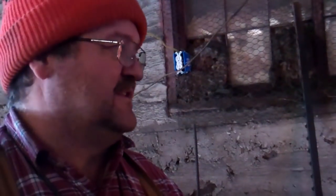very high hardness, I can quench this stuff to Rockwell 67. Temper it back down to about 64. It's extremely hard. But it's got very little abrasion resistance because it's pretty much just iron and carbon. So you can keep it sharp with just a strop for a long, long time. Whereas modern steels, after a month or so, you have to go back on the stones.